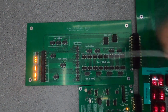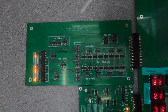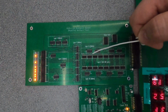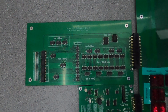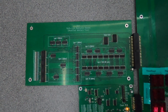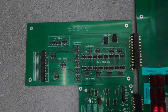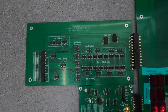And there has been a lot of very careful selection of which bits to add at each level. You don't want to choose the wrong bits and then have to add more layers of adders. There's been a bunch of optimization to try and pick the optimal bits to add at each level. This is based on the Wallace tree design, which doesn't use 4-bit adders, it uses 1-bit adders, which is great if you're doing a hardware silicon design, but is not what we're working with here. We're working with 5 plus 4-bit adders, which is a different kettle of fish.